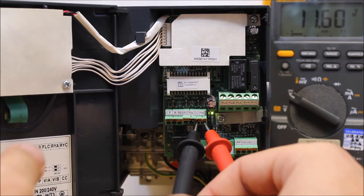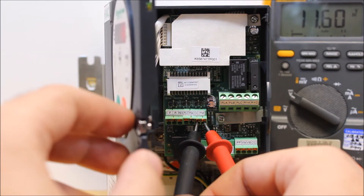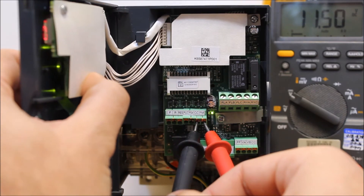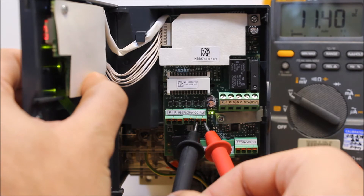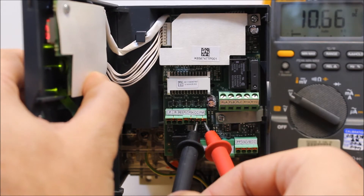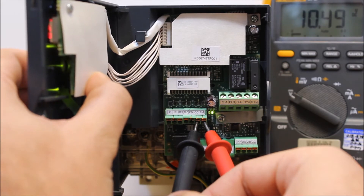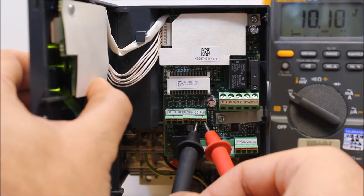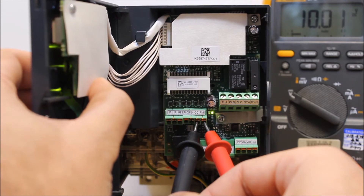To scale, it's a little bit tricky. Your drive is still going to show 100 as the value, but you need to hit the down arrow key — or up, depending on where you are — until your own measurement shows 10 volt DC. I'm hitting the down arrow key right now because you want to go down. Your drive display shows 100 and doesn't change at all. We're almost there — 10 volt.